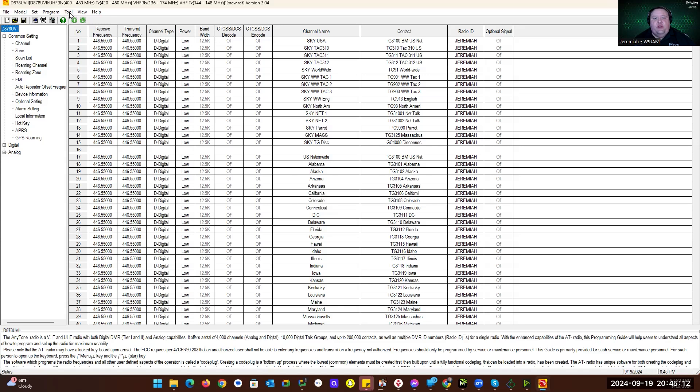Now I can go to firmware update mode on the radio. Once the radio reboots and we're back to the main screen, I'm going to turn the radio off. Then I'll press and hold — on mine it's the tealish blue/green colored button for the 878 UV2, and on the 878 UVs it's going to be the sky blue button — press and hold that button next to the antenna and your push-to-talk button at the same time with the radio off. Then, while holding both of those, turn your radio on. You should get a red blinking light right next to the volume/power knob switch. You'll see I've got the red blinking light now.